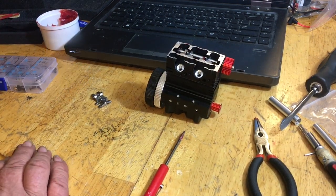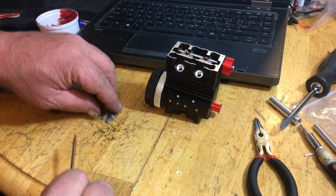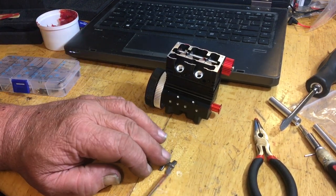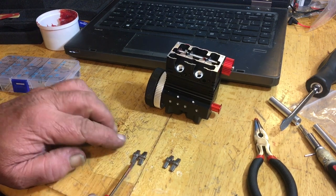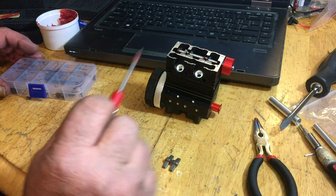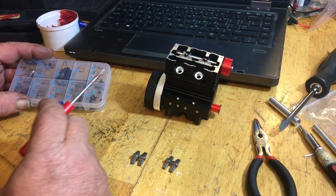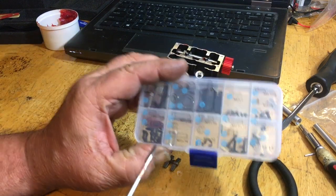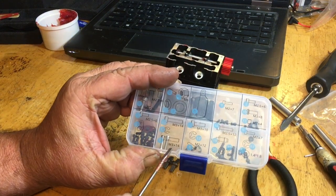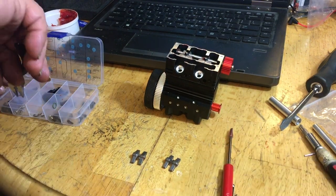Okay, welcome back from intermission, guys. Now, I did have my rockers put on. I put my little e-clips on there, and I lubed them up with grease because we're going to pack all this with grease in here before we put these in. So those other two chrome screws that were in the bunch over here, number 15s, the M3 by 14s, those hold your rocker arm down.